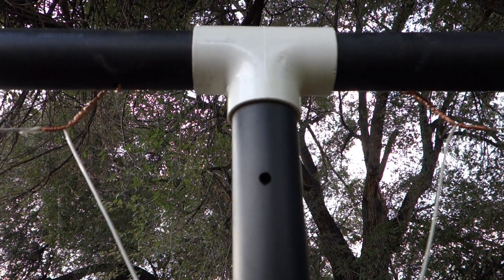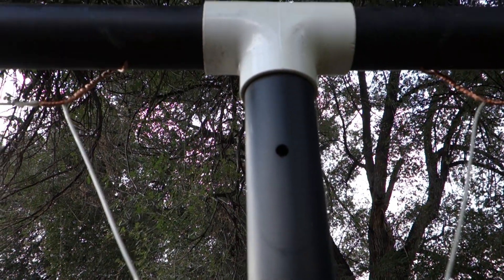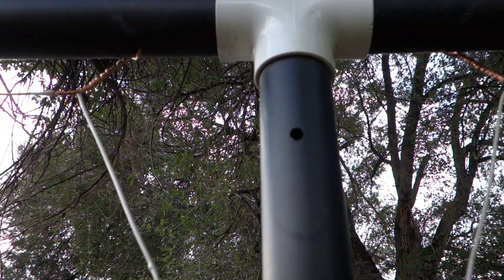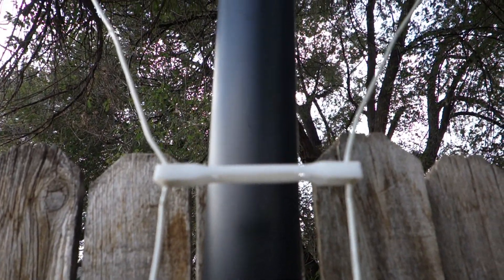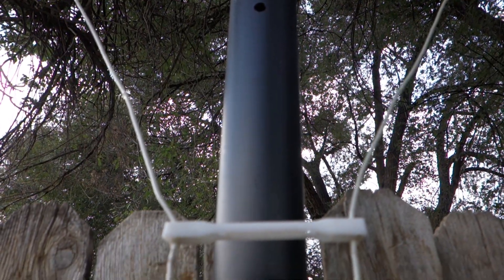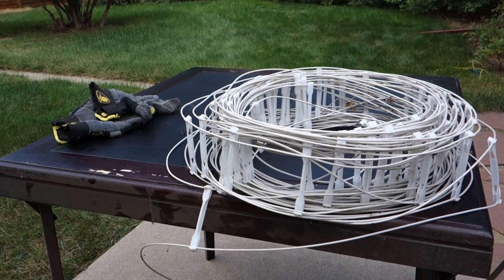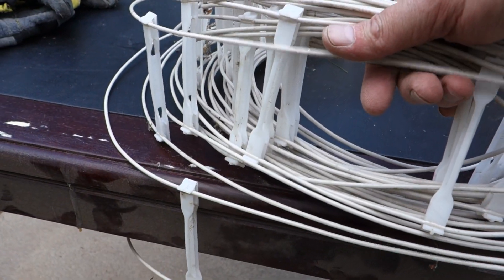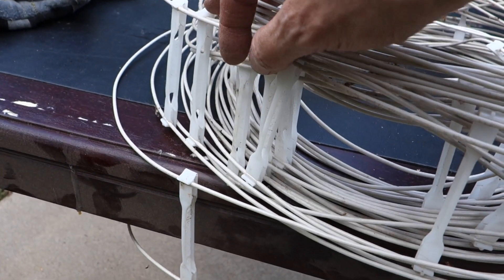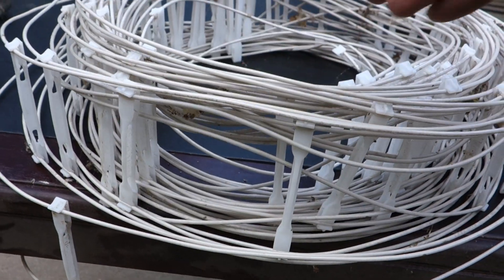Here we are back at the antenna. We've got the 600 ohm feed line attached, coming down at a right angle. We've attached that with some wire ties and can seal it up with electrical tape or any other compound to keep moisture off the copper and prevent oxidizing. You can see one of the spacers of the 600 ohm line. I come down at a right angle with a specific length of transmission line - this was built from, I think, CNC73. You can see the ladder snaps - those are called ladder snaps and you just build them yourself. The antenna works great on, believe it or not, 160 through 10 meters. It's a very small loop for 160, but the length of transmission line helps.